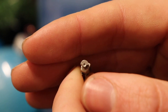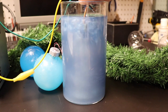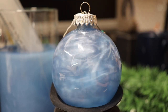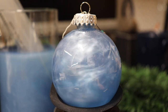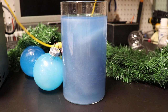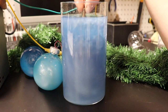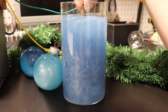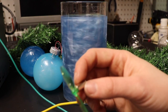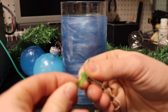So here comes the stupid idea: let's throw an electrical motor inside the mixture. Surprisingly, there's not an immediate failure. In fact, it's been about 10 days since I made this project, and in that time the ornaments have been operating fine for about 8 hours a day. So why is this? Despite using tap water that contains ions and various minerals, there's not actually enough particles in there to create a short circuit immediately. This is where using distilled water will give even better performance. While we didn't experience an immediate failure, there will still be corrosion occurring on the motor brushes due to electrolysis, and this will definitely lead to a premature failure. However, given the performance so far, I'm fairly confident that we should be able to stretch it until the holidays.